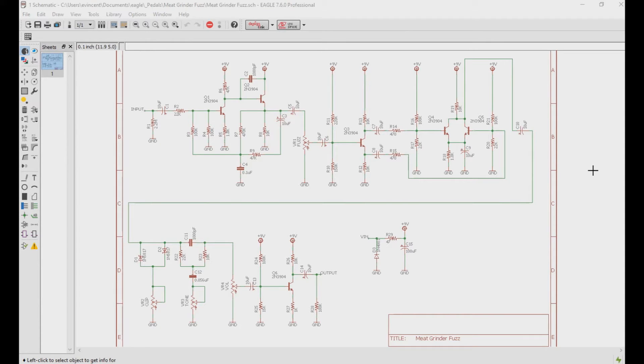This then goes into our next section: a push-push amp frequency doubler. The push-push amp allows for a fully active full-wave rectifier. The BJT splitter here, Q3, roughly gives unity gain of AC signals of opposing polarity — one on this line and one on this line. Then, following the transistor pair of Q4 and Q5, these both rectify and amplify the combined signals. This topology is notable for providing gain during rectification.